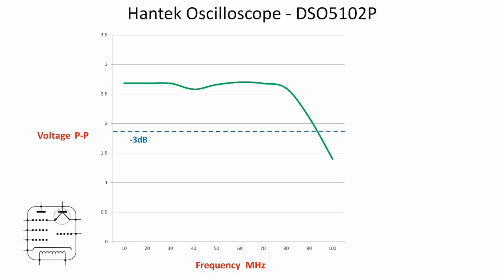That's at a time base of 20 nanoseconds. As I've just shown, the time base speed really shouldn't make any difference to a constant input signal. But now I'm going to overlay onto this graph the same results for 8 nanoseconds — and as you can see, that's quite a different shape. Assuming my TinySA puts out the same signal level as frequency increases — which I can't be sure of — one thing is certain: both sets of measurements came from the same instrument, so there's clearly a difference.